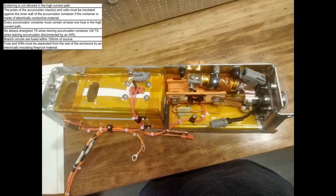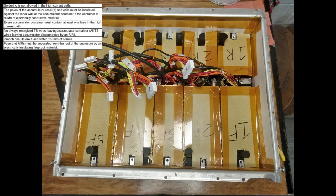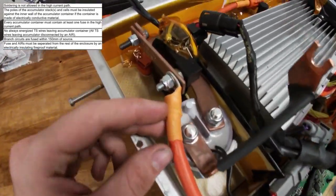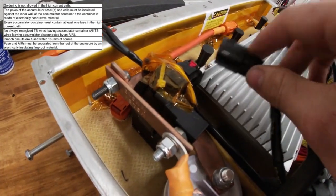The bottom side of both lids are similarly covered with either the aramid paper or the Kapton tape for insulation. The tops of each segment are insulated just as the sides are. The tops, however, are insulated with pre-preg Kevlar which we cured ourselves, and sealed on the sides with Kapton tape. The high current path starts right here at the negative pole of the accumulator and runs through this wire to where the energy meter would be, and that is what this connector here is for.